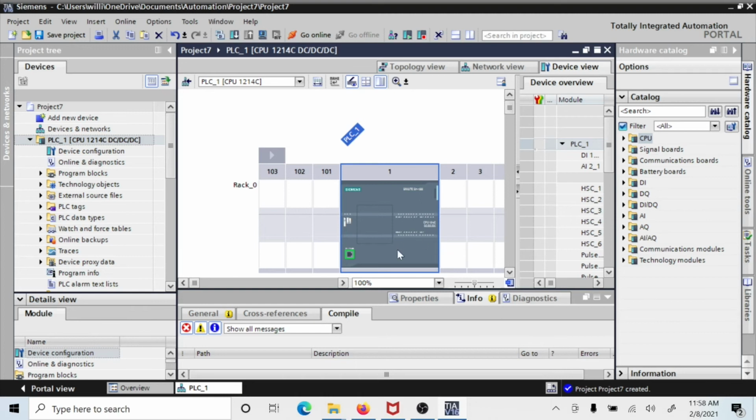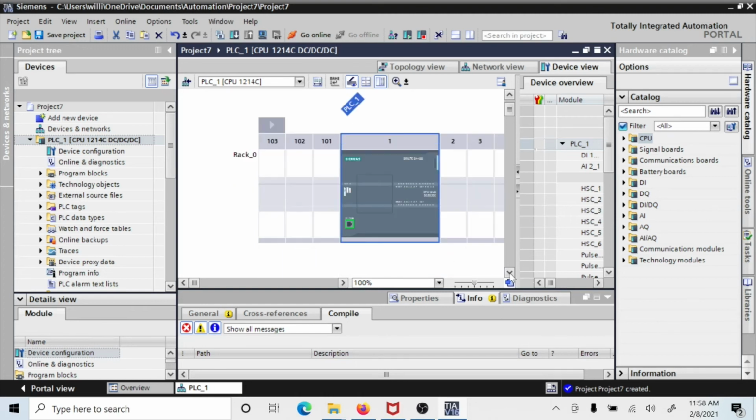So now we have a 714 sitting here and looking at it. This is just setting up a new processor, and you can add cards, you can add all kinds of stuff, but that's a bare processor there with no additional cards on it. And right here is an area for a signal board, and the 714s come without an analog out. So they basically at one time sold the kit with a signal board that you added right here, so that would give us analog out.